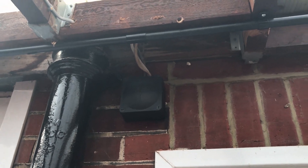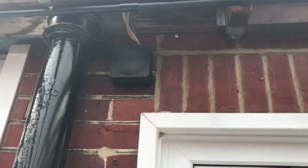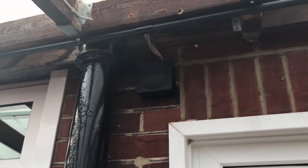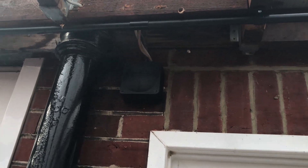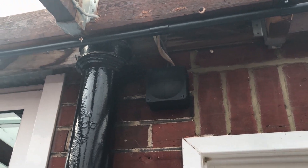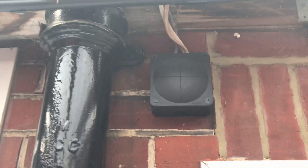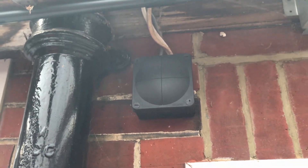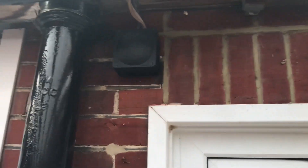I had to find another way of doing it because there's a junction box which has been lost somewhere underneath the flooring, which is obviously a tiled floor. So I managed to make the switch wires into a permanent live which ran down to the switch. Once we had our permanent live feed, I used this adaptable box and put a module unit inside — which is a receiver for the Kinetic switches — as you can see. It makes a nice neat job, all out of the way.